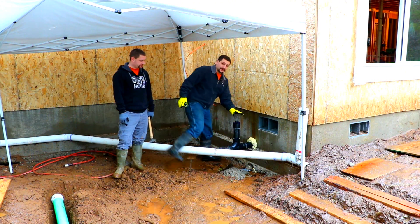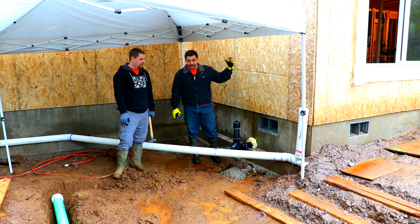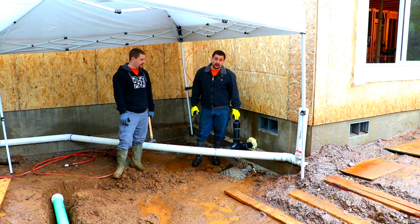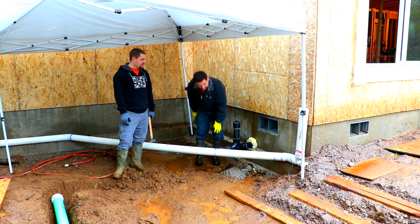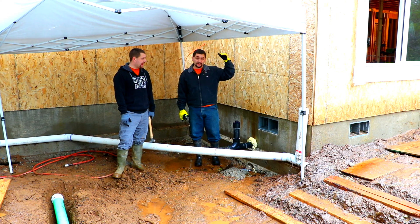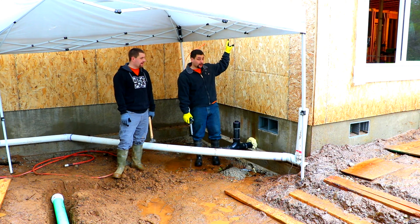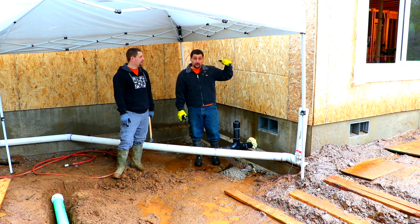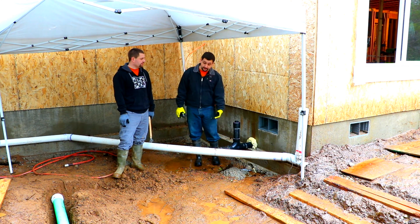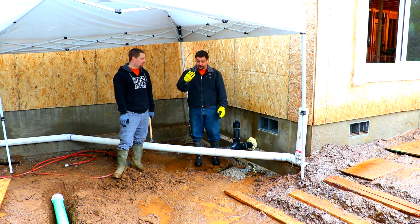This is the pipe that carries everything from his toilets, showers, and sinks — anything with water in the house drains here, comes out, and goes into the septic tank. When they install this, they test it by plugging everything. They put a little clear plug right here that's glued in place internally, and you break it out with a hammer. They test it by putting all the plugs in, going on the roof, finding the highest vent point, putting a garden hose in there, and filling the entire system up with water. I went upstairs and tapped on some of the pipes — water is pretty high in this system. That's how they test all the joints. We have to get all the water out so we can glue this to the septic tank. He's going to knock out the little plug, and there's a lot of water draining out of the house.